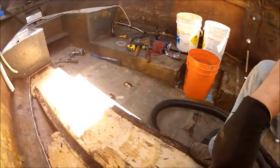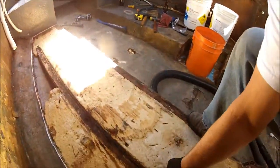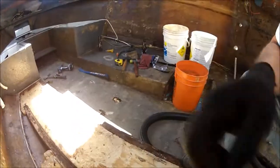All of the decking that was put on here, I don't know if you can see them there. I had one pulled out I was going to show you, but the decks were assembled, mass-produced with pneumatic staples that were probably about 1.5 to 2 inches long, and the deck was just stapled down to the stringers. And you can see here when they applied the foam, which I like, it's a closed cell foam, we applied into the compartments, but you can see there are a lot of areas that they didn't completely fill.